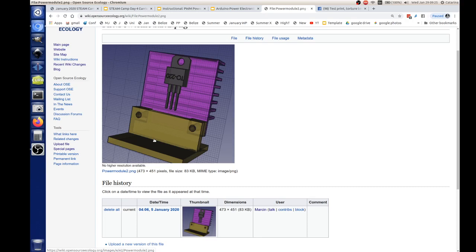So we'll be able to drive this using PWM to adjust the speed and torque of the motor. For example, in the cordless drill challenge, we can use a system like this to have full control over the speed of the motor, which is more advanced than typical. Typically, it's just on off and multiple speeds with mechanical gears. Here we can do otherwise, so we have extra capacity. We can still use DC motors, and DC motors are easy to control using this kind of thing.